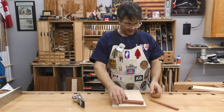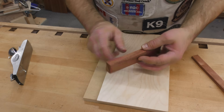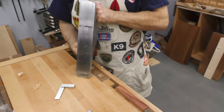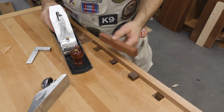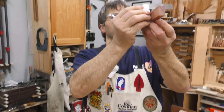We've got to get these pieces ready. I prefer not to have saw marks. The only thing that's critical in terms of being square is the front face — it needs to be square to the bottom that's glued on here. I'm going to flatten that bottom off using my 5.5. Then we'll check the grain direction and get it square and straight.